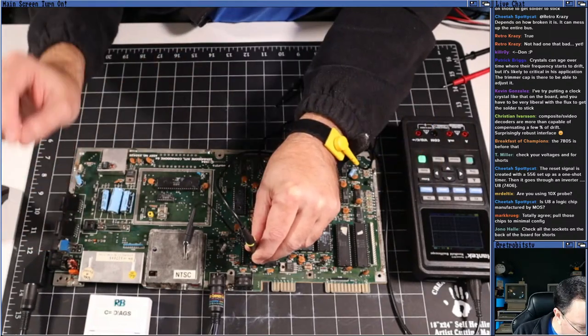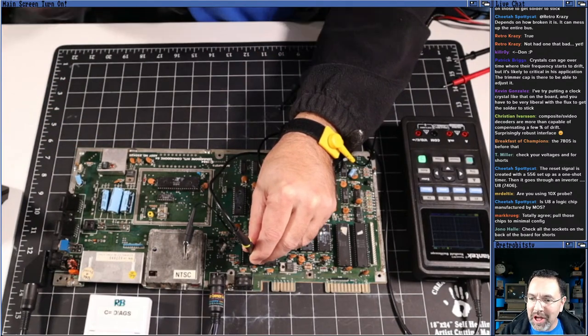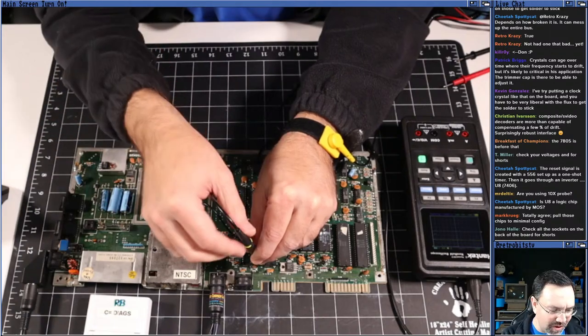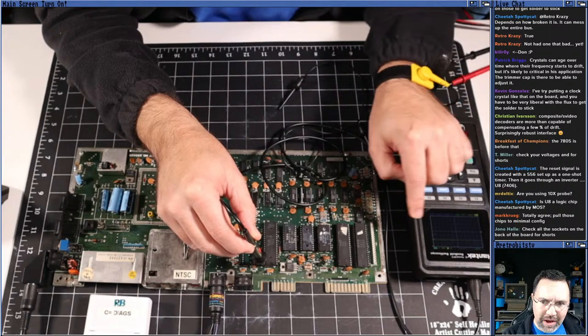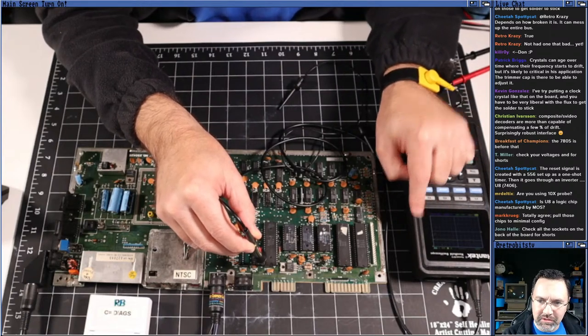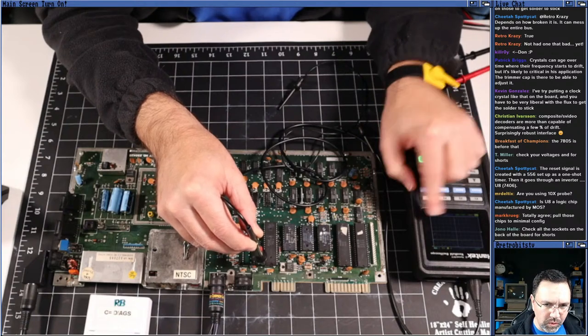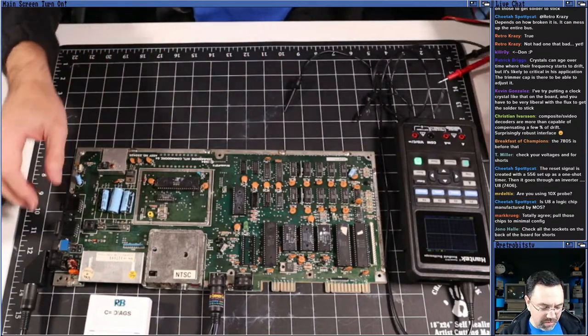All right, 2 volts per division. There we go. So it's not the Commodore. It was the probe setting. I've always used this with 10X and a 10X probe, but when I connected it to the PC, the software reconfigured the settings on my scope.